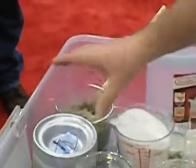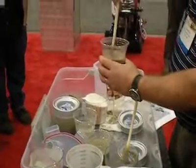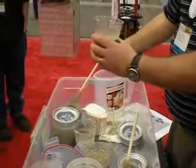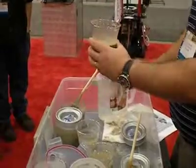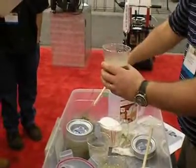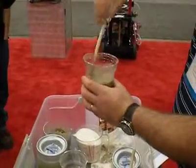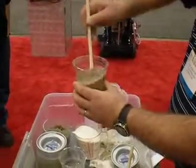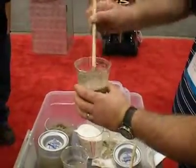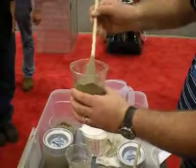Now, let's say you don't have a large quantity of slurry and you just want to gel it. Slurry is 80% water and 20% solid. You can just gel the whole product if you want to. But if you're doing a large quantity of slurry, it's good to flock it first. That way you separate and get rid of the water you don't need. This will turn the entire slurry into a non-flowing gel in less than 2 minutes that we can throw away at the job site.